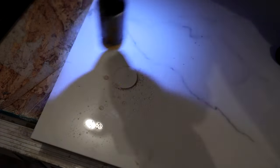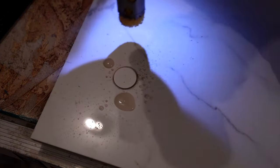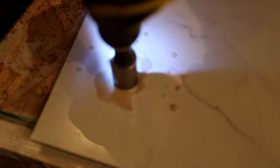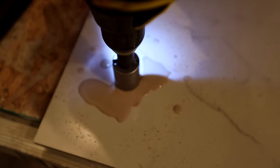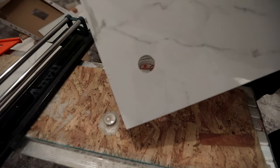You've made a moon shape, and now that the drill bit is stable, rotate it vertical so it cuts the hole straight. Get some more water. Now you have the circle started — as you drill, rotate slowly and don't push very hard or you'll break the tile. Remember to add water frequently, and there you go — a really, really good hole.